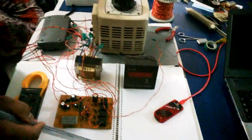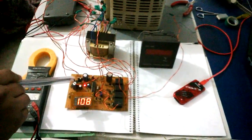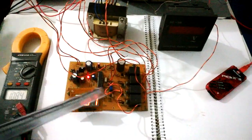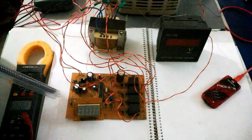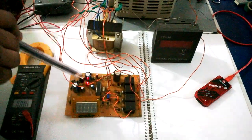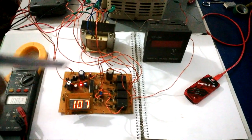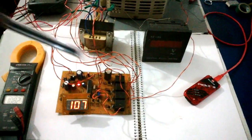Assuming this is initially turned off and then I just turn it back on, there's an initial delay before which the seven segment display turns on. You can see that there's a delay while that LED is on, which shows that there's a delay, and then this turns on showing that the circuit has been turned on.